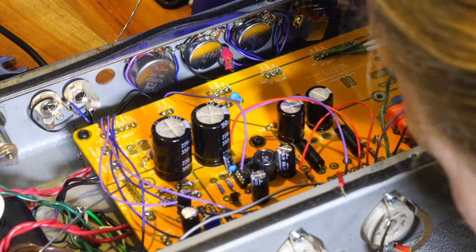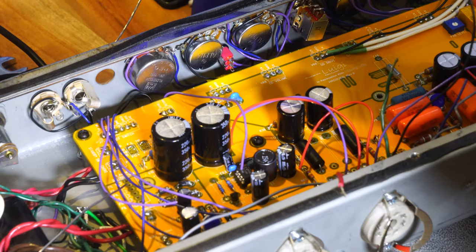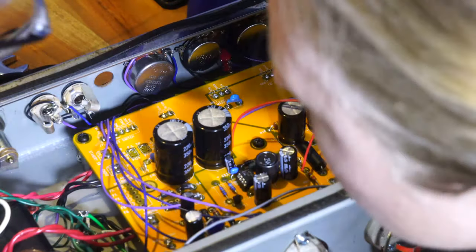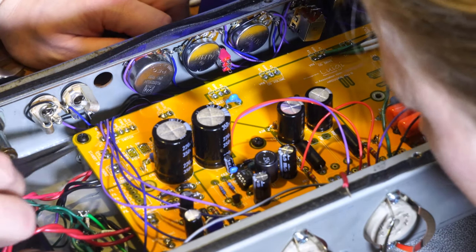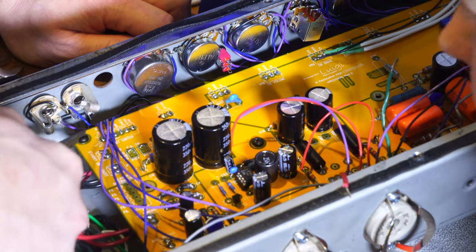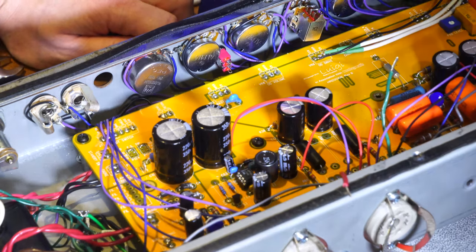So, all right. Now it's time to wire up the second part of that, which is the bottom wire down there with this one. It does, but the one thing I usually like to do with these is bend them once they're in and then reflow the solder after. So that you still guarantee a good physical connection, and then you solder it again, just reflow it a little bit.